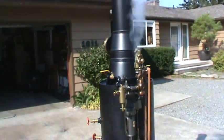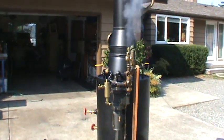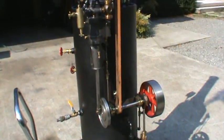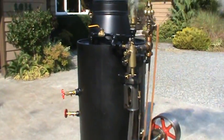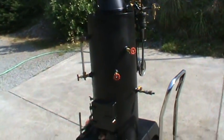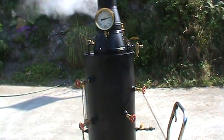I don't have any more engines and I don't have any more flyball governors either, so this is the last one. I don't know when I'm going to get a chance to make another one, but I'll be building more — just different engines. This is a 16-inch diameter boiler, 38 inches tall, with 24 copper tubes rolled in.